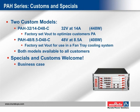The second special model developed using the PAH platform is a 408-watt unit that delivers 48 volts at 8.5 amps. The application has nothing to do with RF power amplifiers; these bricks power the fan tray in an ATCA chassis. The PAH series was selected simply because of its ability to deliver 48 volts at the required power level. However, with a trim range of 24 volts to 50.4 volts, this model could also be used with 50-volt LDMOS power amplifiers. Both special models will be available to all customers.